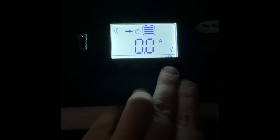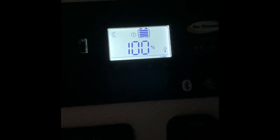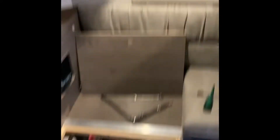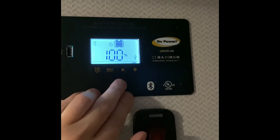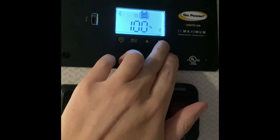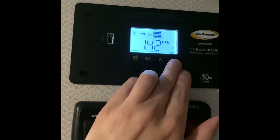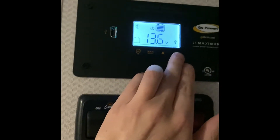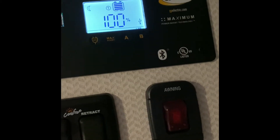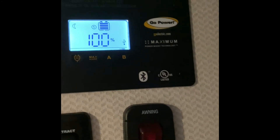We're ready to go. It's giving us 100%. We haven't switched over the battery — let's check it out. Let's switch the disconnect and see what we got. The lights are on — looks like it's working! Everything's powering on, messages coming up for the camper. Let's cycle through our battery readings here: 13.6 volts, zero amps, and 100%. So we'll check this maybe tomorrow, but everything appears to be working correctly. Pretty exciting!